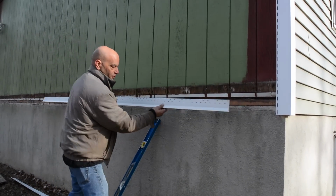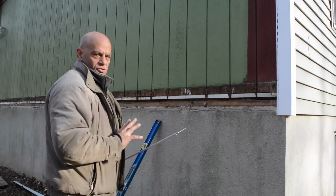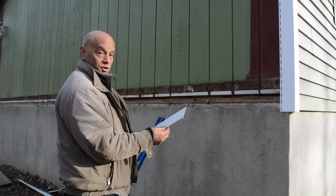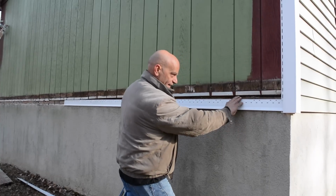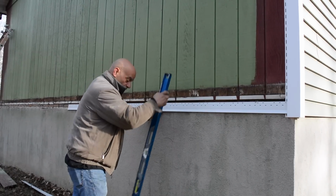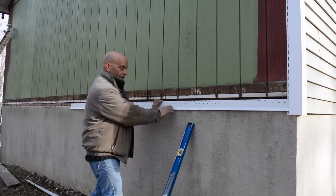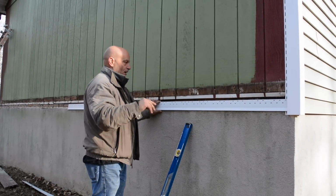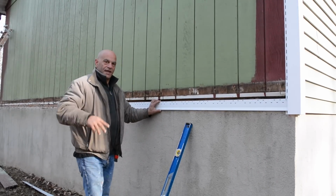So what I end up doing, which I'll show you, is I'm going to get a piece of scrap siding, so it's small to work with. Once I put that piece of siding on our starter, that's going to come down a little bit more. So we just don't want to start at, say, our 3/8 of an inch here. We want to put that scrap piece on to find exactly where we're going to be with our starter, and level it with a nice long level. Even a snap line going from one side to the other would be the way to go. And then after this is in, we can start putting our siding on. And that's when it becomes fun. Right now, it's a bit of a pain. So let's get over and measure and see what we have for our post, and then we can cut that and put that on.